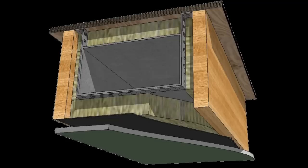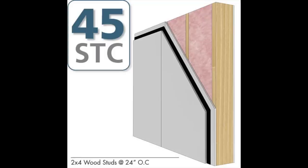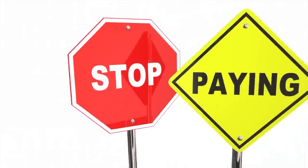This makes for excellent soundproofing as it covers the entire surface without leaving any gaps. High STC score: Sound Transmission Class, or STC, is a unit of measurement for sound. MLV's STC score is 25–27, which is a great score considering its thinness. To increase MLV's soundproofing capability, one only needs to add as many layers as needed.